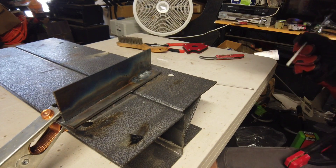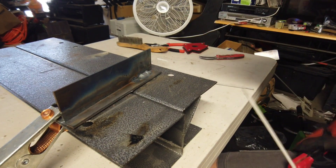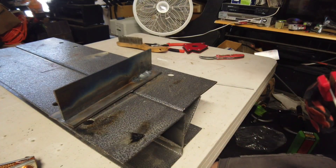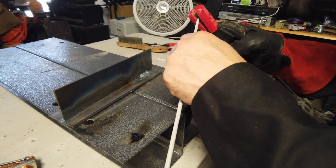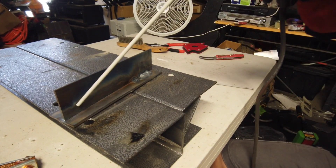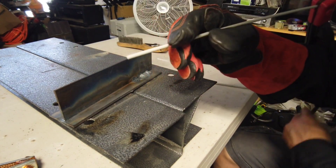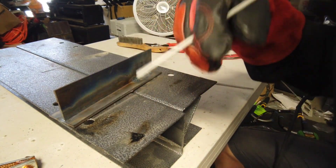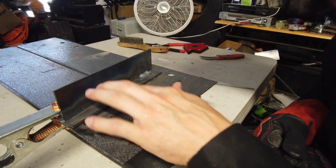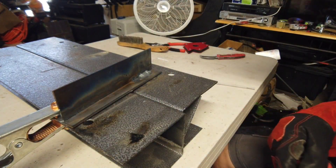One quick thing: if you're going to try to tack a piece in place, you can always hold your stick — say you've got your stick set up and you're way out here trying to tack it. You can get up real close and hold the stick like this and just get in and buzz it out real quick. This is eighth-inch material — I'm just going to attempt to do a fillet weld on here and see how it runs.